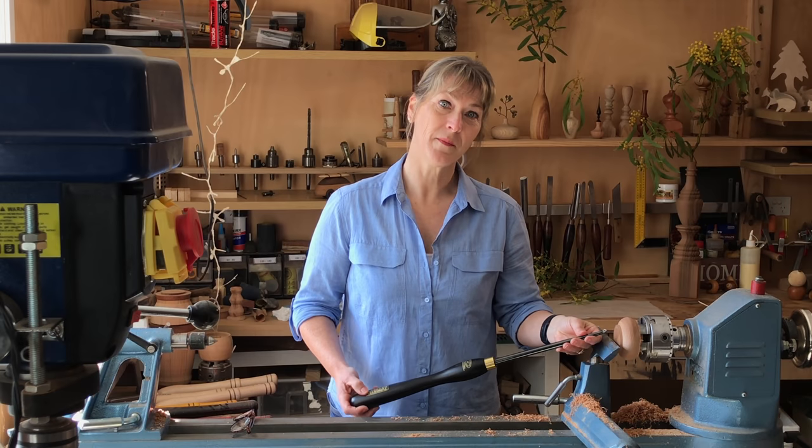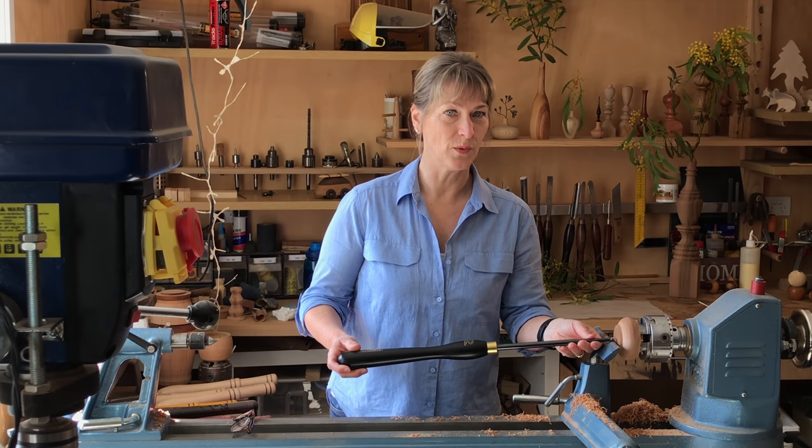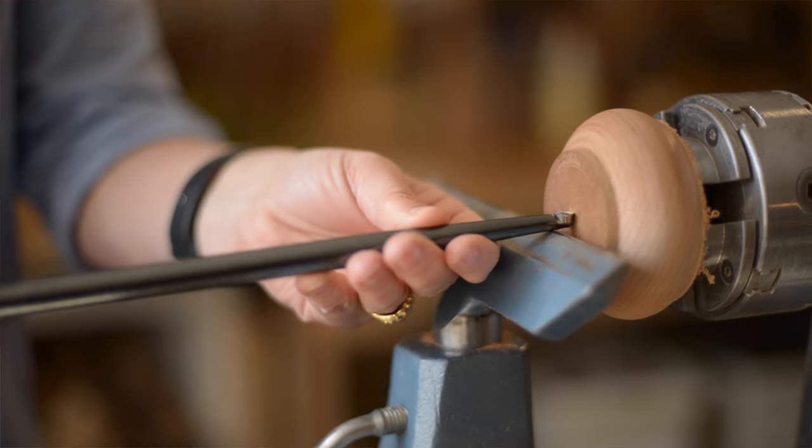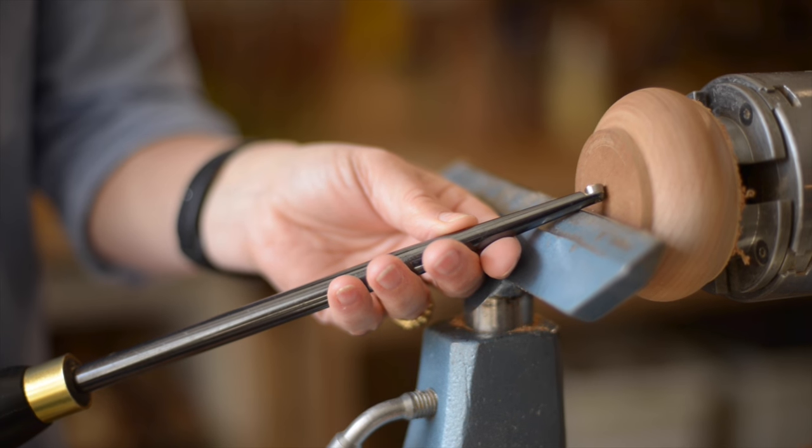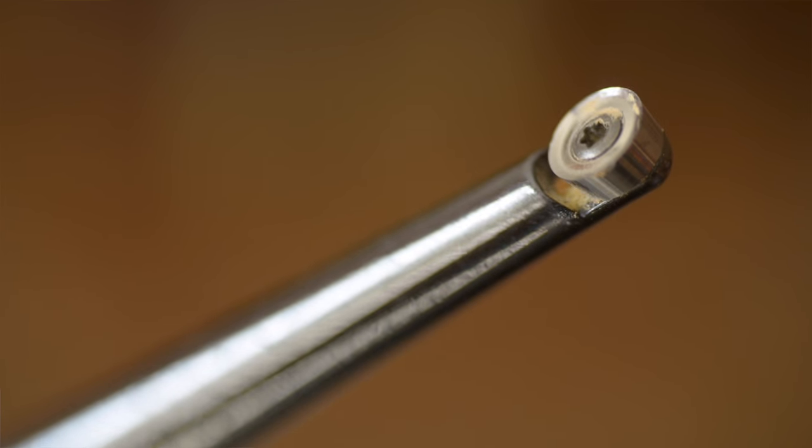Now I'm going to be honest here. When I first started using these tools with the cupped carbide tip, I presented them like my other cutting tools at a horizontal angle — that's wrong. You don't do that. You present them on an angle and you make sure that you find the bevel first and then the cutting edge. The carbide tip is cupped, and that actually means it has a totally different finish to most other cutters. The other cutters act more as scrapers — the ones that you present horizontally. When they're cupped they will give you a much finer finish at the end, which is another reason you have to have them angled.